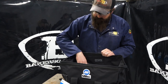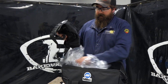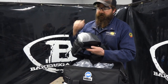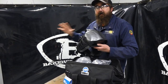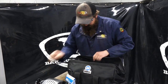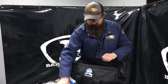In the back here we got our belt unit, and this is the actual air unit that feeds air to the hood. The battery goes here, and this is the pump — the air pump that filters air through here and then pumps it into the hood. So it's a positive pressure hood, pushing air in on top of your face and pushing the air out, keeping all the contaminants out but also giving you fresh air inside. We got our tube that feeds from the air unit to the hood.